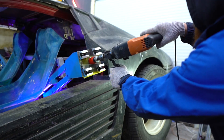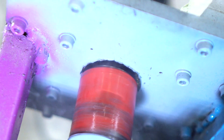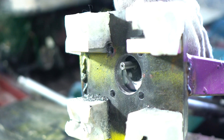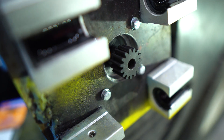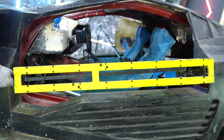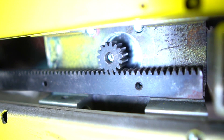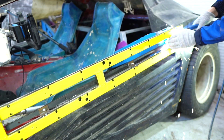First you need to fix the stepping motor on the platform prepared for it in advance. I made a hole for its shaft in the platform with a hole saw. I took the most powerful engine in such a form factor with a good torsion torque, as the weight of the finished door was still unknown. There'll be a toothed bar on the door frame, attached with the help of angles under the gear of the stepper motor.